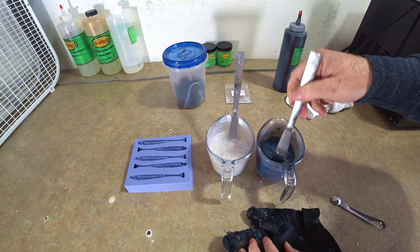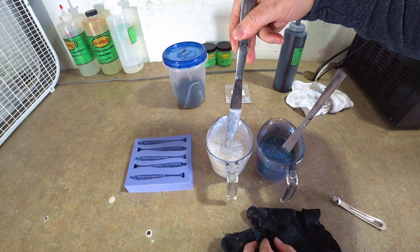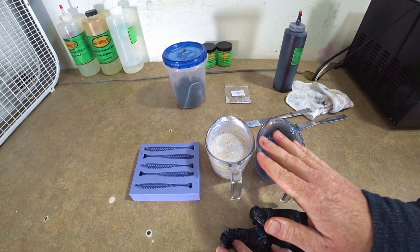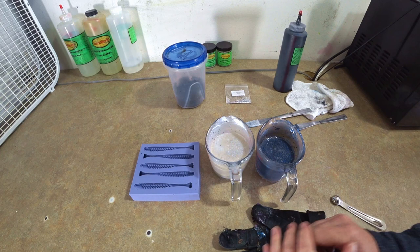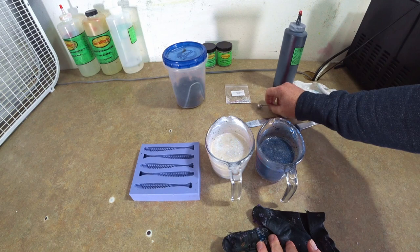So we have these two colors — this one is gonna be the top, that one is gonna be the bottom — we're gonna do a laminate of sorts. About hand pouring: it's a lot easier to pour with really hot plastic; the hotter it is, the more runny it is. However, you can get really great effects by playing with your thermals. If one color is much colder than the other, they're gonna mix in cool ways. We're going for more of a straight laminate today so we want them fairly equal in temperature. I'm gonna pop them back in the microwave and meet you back here.